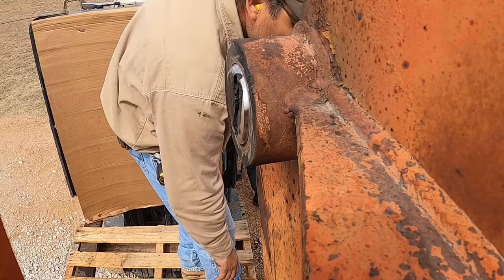So it turns out it doesn't look like I'm the first person that tried to press this thing out, because there's some evidence of angle iron that was welded at one time or another. And initially the pin comes out in this direction because I think it had a washer end to the pin this way. Of course the set bolt is on this side. But since that side got mushroomed out, trying to knock it in this way, we're gonna go that way. And, you know, an 8-pound hammer can only make it go so far. So hopefully a 20-ton jack will make it go further. So that's the next step. So here we go.